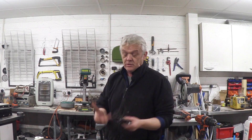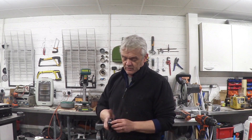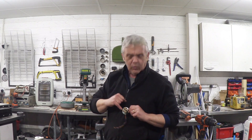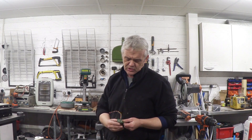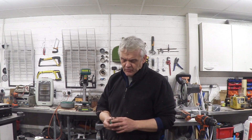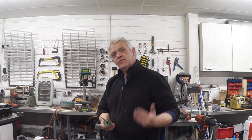We're going to use this magnet as it comes — it's all balanced and set up — so nothing we can do about the magnetic field. The rate of spin is going to be proportional to the wind speed we plan on sticking it in. So about the only thing we can do is increase the length of wire, and rewind it with longer wire. It's pretty traditional to take these boards off, solder to the ends of the coils, and have yourself a generator. We're going to do exactly that: remove the board, remove the wires, and then rewind it.